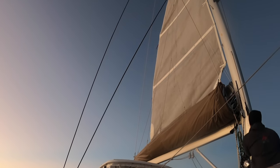Laminate sails, depending on where they're sailed and how they're treated, can sometimes delaminate. The glue that holds them together simply fails. Friends of ours have said that their laminates delaminated after 4 to 5 seasons. But the only problem we ever had personally with our laminate sails was a blown out reef tack. Otherwise, the sails performed flawlessly and had no delamination issues even after 7 seasons.